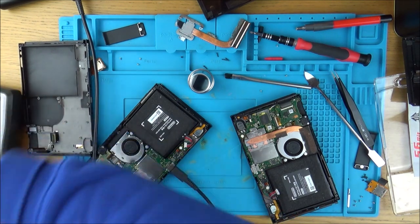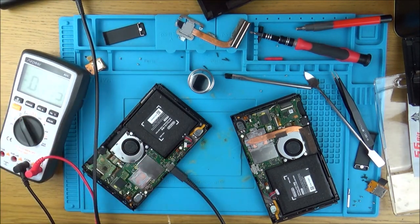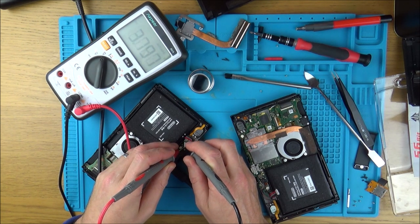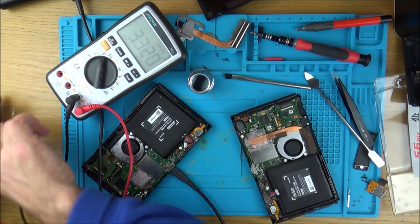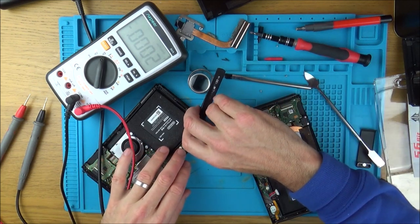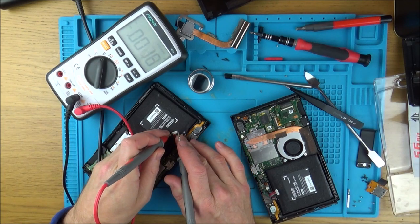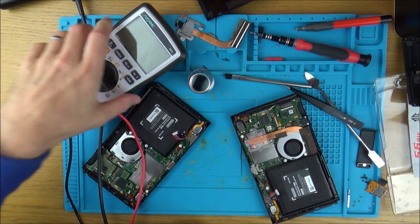It's been about an hour. Let's see what's happening with the battery. I'm going to take a reading while it's charging, then unplug and get a reading on the battery itself. It's nearly gone up to 3.8 and still rising — it went up to 4.06. Now let me unplug it and take the battery out to test it directly. It's at 3.7 volts — fantastic! So maybe the battery will be saveable. I'll need to charge it quite a bit longer.